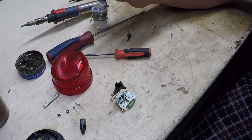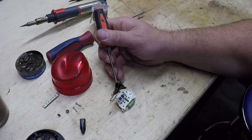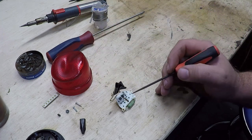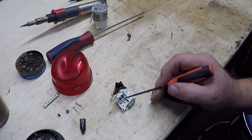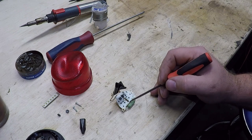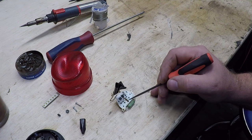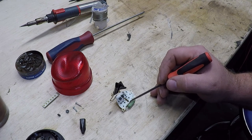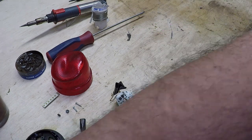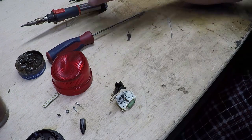I'm going to try to solder right down here — this little solder joint that's broke — I'm going to try to solder it back together. And then there's a little solder joint at the end of this little guy we're going to solder back together. And then we've got a trace here that's been broken, so we're going to probably put a jumper in from this point to this point and just jump over that crack. Then we'll put the LED strip back in. That's the plan — can't guarantee it's going to work, but we're going to give it a whirl.